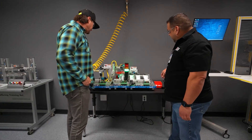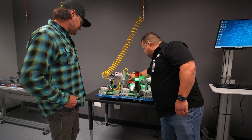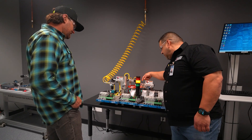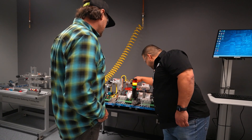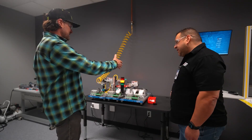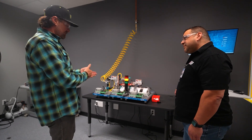What do we have here? Here you'll see it's kind of like a sorting tester. It runs a test where it'll have a hockey puck cylinder, it goes through the shaft, and it pushes it into placement. It'll get pushed in, it'll sense it — if it's clear, it'll scan it. It'll tell me yellow, because they're actually looking for a silver one. As it rotates, it'll send it over, drop it to the conveyor, scan it — if it's the silver one they're looking for, it'll drop it this way. But because it's not, it'll go to the next one. This could literally be in a million-square-foot warehouse, operating hundreds of these.